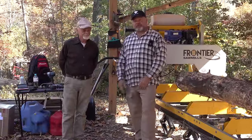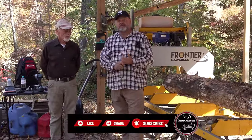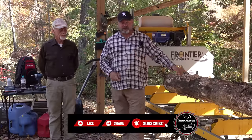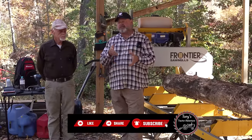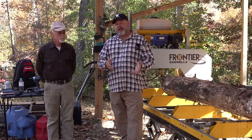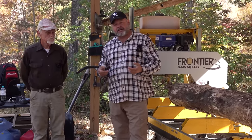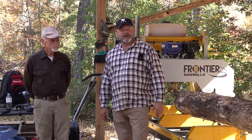I've got John here, he's my good friend. Hey. And we're going to cut up a 16 foot long 6x6 tulip poplar for the greenhouse. Now it's not gonna be a perfect 6x6. I'm not sure that we can actually get a perfectly square cant all the way down. Doesn't really have to be. And if it has a little wane down the side, it's gonna add some character. What we're gonna do is take you step by step of our decision-making process. We've already set the log up on the sawmill, and we'll go from there.